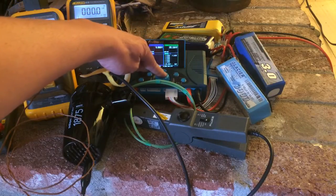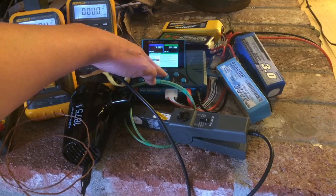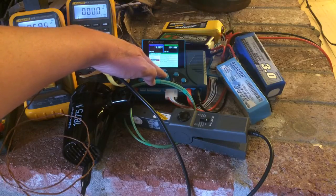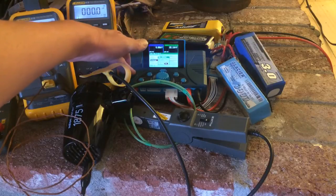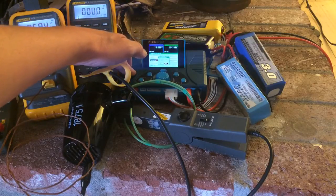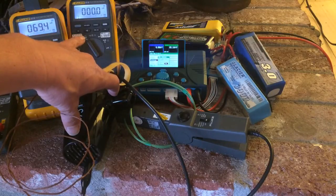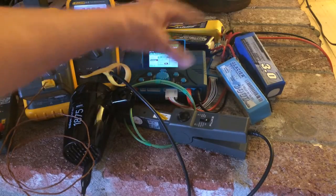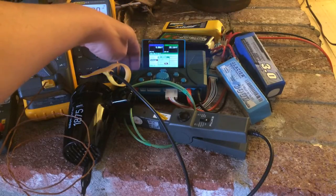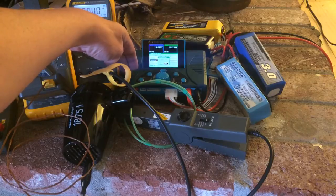We're going to attempt to discharge them at maximum capacity of 33 volts, 30 amp, regenerative cross-channel discharge into the resistive load, and see if we can get it to go to maximum power. On the first run, I determined that the input voltage and input power to the iCharger was insufficient. What I'm finding out is that the amount of cross-discharge power you're attempting to discharge to the resistive load requires approximately one-fourth of that same amount of power from the input side of your power supply.